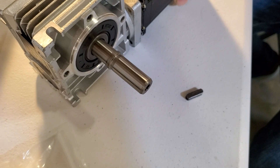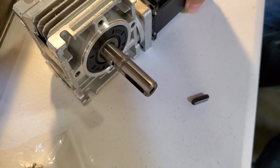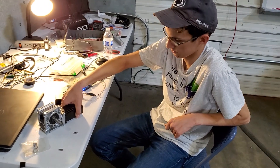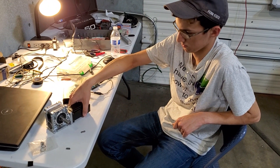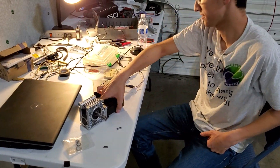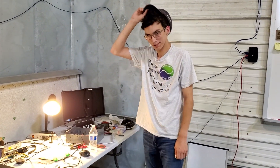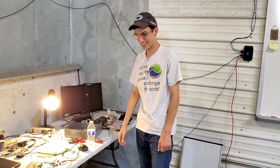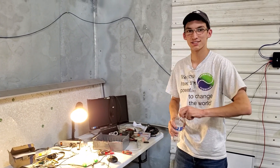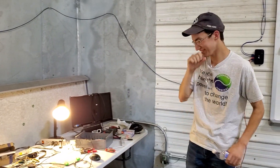So there's our worm drive, going about 12 seconds per rotation — it would be about a two-minute fully closed to fully open cycle. Right now we're looking at how fast we can get the stepper motor going; if not, we'll switch over probably to a servo motor. Thank you Ben. Sorry I forgot the limit switches today, but they were an easy fix — we can make an easy substitution with wires and magnets, and the special janky configuration.